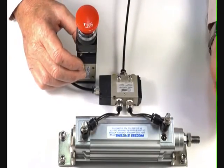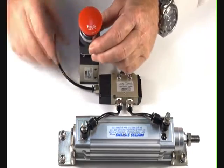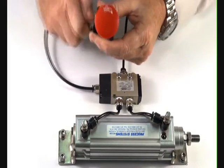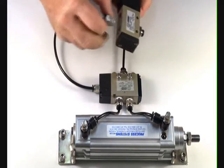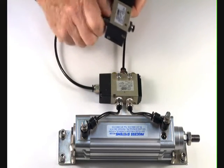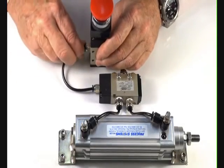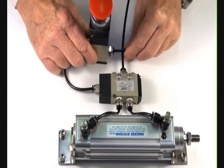Demonstrating the palm button latching 3-2 emergency stop valve, quarter BSP. Fitting into the outlet port, one into the inlet port — gives us a 3-2 normally closed function. Connect the outlet port to the pilot end of the main valve, air supply on the inlet.